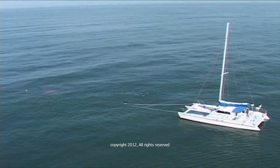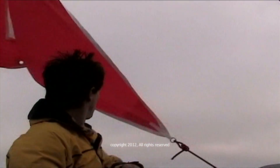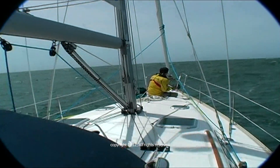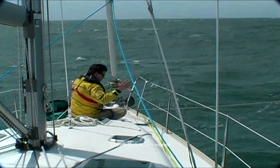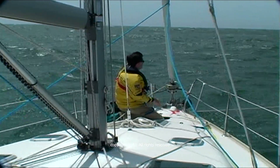Or we can fly what we refer to as a free-flying riding sail — basically a storm sail that we fly like a kite off the back of the boat, which helps us maintain a head-to-wind position. Those are some of the little tricks we've learned over the years to make things work better. The typical standard operating procedure from all manufacturers out there is just to pay out 10 to 15 feet of rope for every foot of boat, regardless of weather conditions — and that was one of the reasons we were able to figure out what was going wrong in those situations.